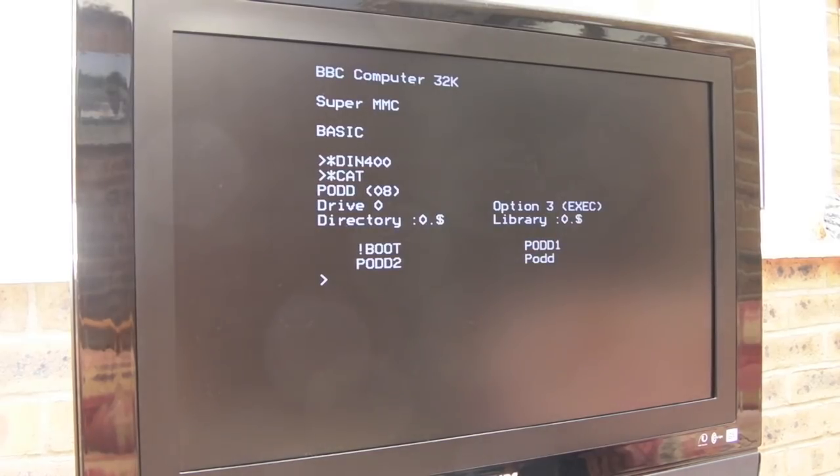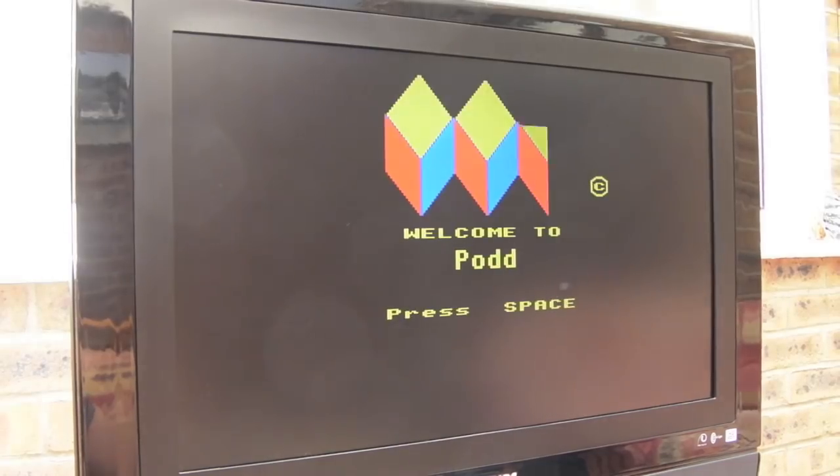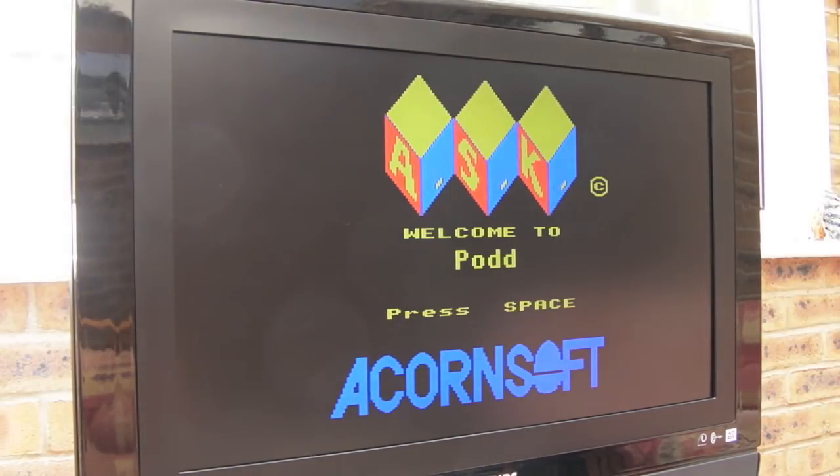So it's just like you've got floppy in there. You can see that one's Pod. So let's load that. I mentioned that in a previous video. It might be in part one, I can't remember. And we can just load it just as normal. Now we've got that disc selected, we can just hold down Shift, keep Shift held down, press Break, and lo and behold, Pod's loaded. So like I said, that was one of my own disc images.